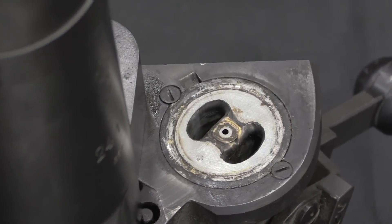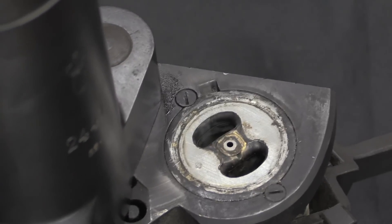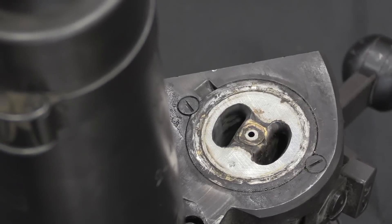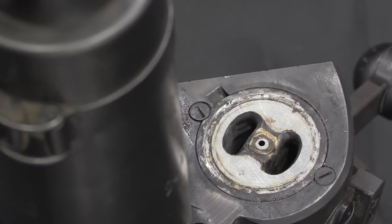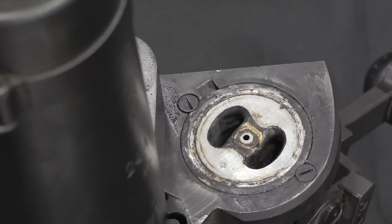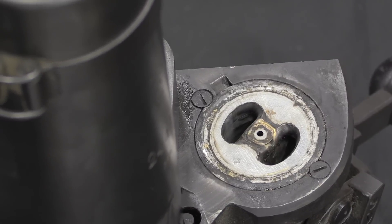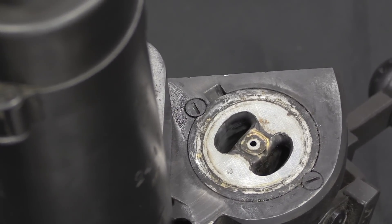This is the actual breech block. It has the same pattern of openings that you can see burned into the empty fired cartridge case. This plate does erode quite quickly — it's getting a lot of very high-pressure gas when you fire. It lasts about 20 rounds of armour-piercing ammunition, or about 40 rounds of practice or high explosive. Unlike many anti-tank rifles, this was equipped with both solid armour-piercing and high explosive projectiles. The high explosive was velocity-independent, so a little lower pressure and less damaging to the gun.